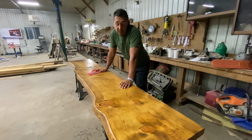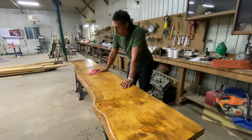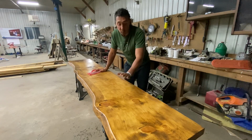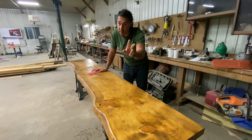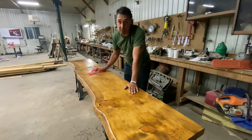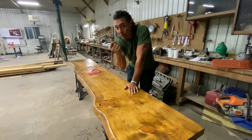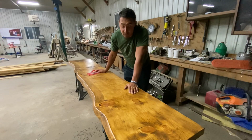Before we jump into this late night project, there's a couple things you gotta know that are super crucial when pouring epoxy. One, whatever you're gonna pour, make sure you have at least 2 coats of oil-based poly on it, at least. There's tiny little pores in the wood, and if you don't seal those up, you'll get little microscopic air bubbles that you can actually see, and they're really annoying because sometimes you can't get rid of them.